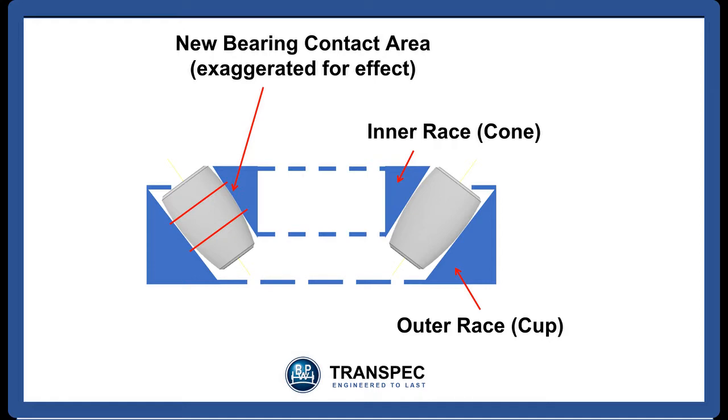But during the settling in period, the rollers have gotten slightly smaller, which means that you have lost your initial bearing setting and the bearings will need to be readjusted. Hence the BPW requirement for a first service. At the first service, which should occur between the first 1,000 kilometers to 5,000 kilometers that the vehicle has covered from new, the bearings must be readjusted as per the requirements shown in the BPW operator's manual.